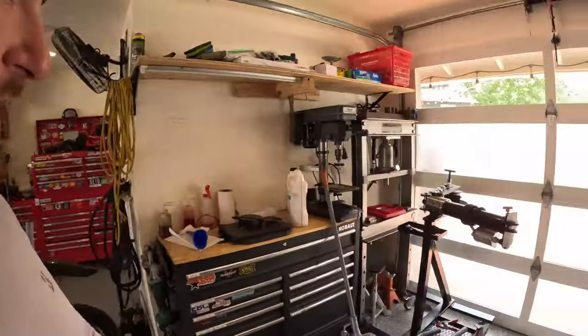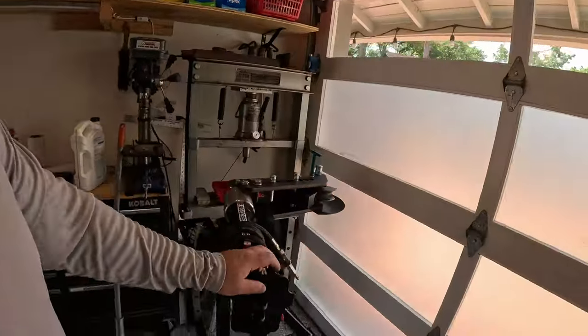It's a pretty straightforward project. Like I said, this design will work for any vehicle that's body on frame. And you basically just adjust the length of your slider to match your wheelbase. This is also going to be our first project where we get to break out the tubing bender. As you can see, it's all set up over here, ready to go. But actually, before we can get to that, we're going to fabricate the main slider parts themselves. And those I prefer to build out of square tube.